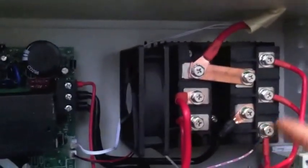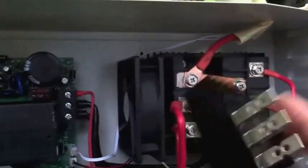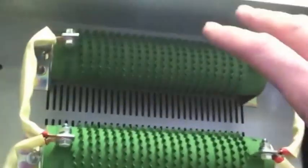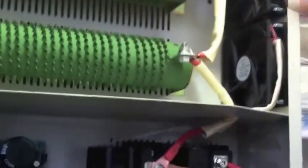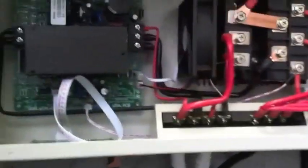I'm thinking it's just the rectifier — it's a little goofy looking to me. I probably could have got away with just keeping half of it, but I don't know what's going on with it. So I'm going to pop in a new one, rewire everything, gut this whole thing out. I'll leave the resistors here and I'll work on some way of rewiring the fans to get them to go. They're 12-volt computer fans, so I'll figure something out. I'm going to rework everything.